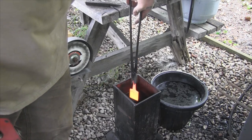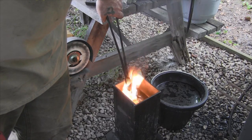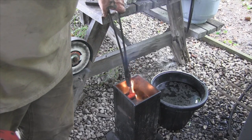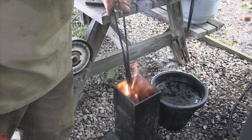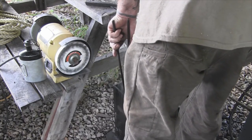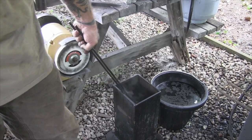Okay, we're non-magnetic — blade in first. I'm waiting for it to turn so it's not red anymore. As you can see it's starting to cool down. Now we're going to leave it in here for about two minutes, pull it out, let it cool down, and sharpen.